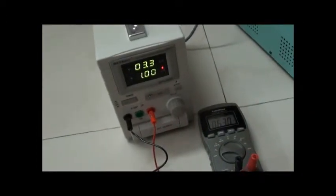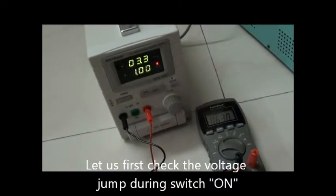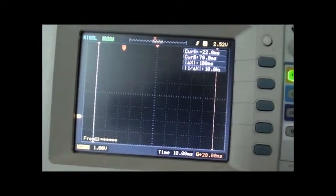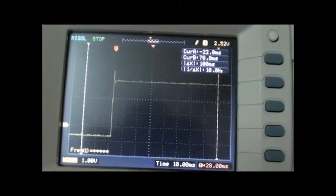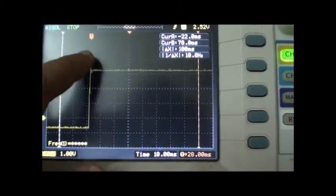For testing, I have set the power supply to about 3.3 volts — a commonly used voltage for microcontrollers and op amps — with the current limit at 1 amp. The oscilloscope is in trigger mode. At present the voltage is at minus 0.6 volts, essentially 0. When I switch on the power supply, you can see it does jump up to about 4 volts before settling at 3.3 volts.